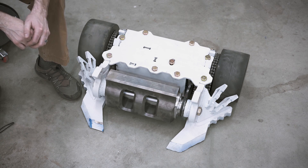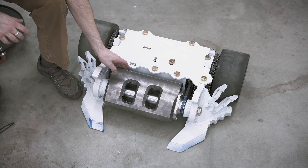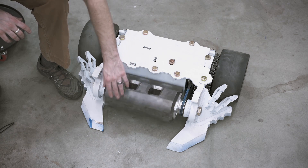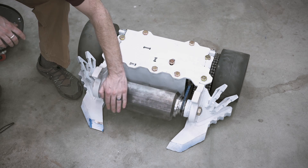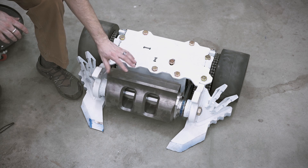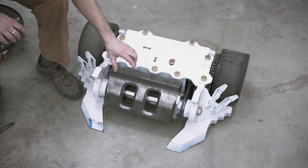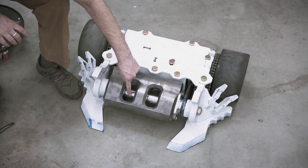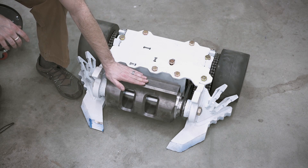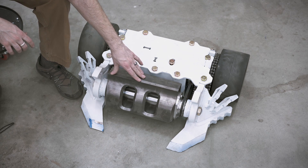Let's start by talking about the weapon up front. Copperhead uses this spinning drum up front. This is a single tooth drum, meaning it has one tooth and then nothing on the other side. You've got a big counterweight on the back to offset the tooth — kind of a Coke bottle design that gets skinnier at the top and big at the bottom. We're using a dead shaft, meaning the shaft itself does not spin — the whole drum spins around it. The drum is hardened S7, which is a really great impact-resistant tool steel and a very common material in combat robots.